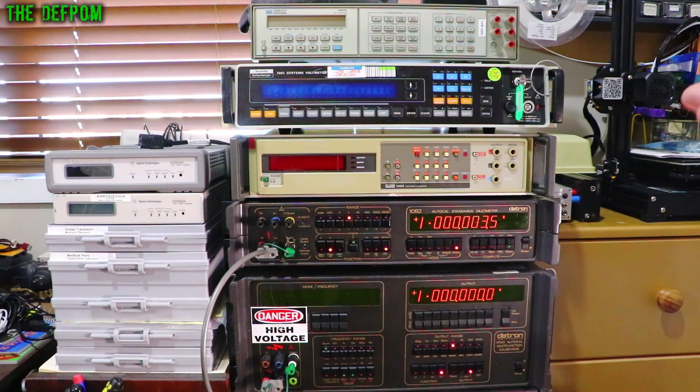I've got the 1082 in my equipment stack now. It's not fully calibrated yet — I've done a rough calibration, but it needs to be fully warmed up, probably 8 hours, then I'll do a calibration between this and another unit. It should be really good then. The price I paid was about NZD $1,200, which was good value for a working unit. The 1062s I've picked up have been a lot cheaper, but those are only six-and-a-half digits and they were broken. This was basically working, so I don't have to do much — just refurb and calibrate once it's all finalized.